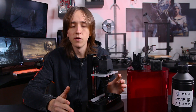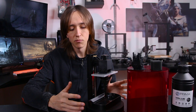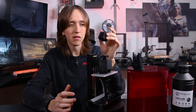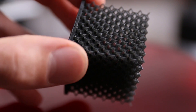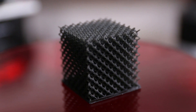But resin prints aren't about big size anyway — they are about high detail. And while this printer only has a 480p screen, so it's not very high resolution, it does still manage to create some very high detail prints. This print here would be just unthinkable on a FDM-based printer. All the retractions needed to print something like this with such intricate and fine pieces — it would just be impossible to do.